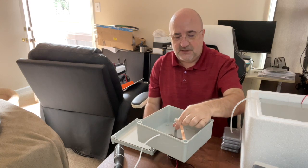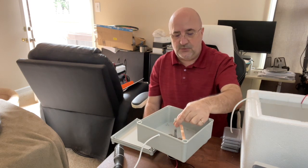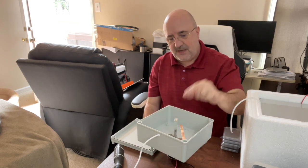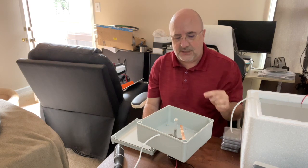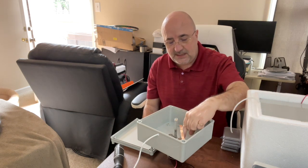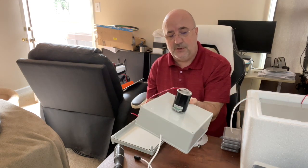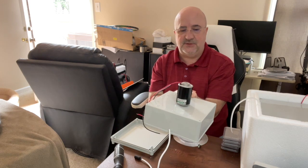This is my shaft: a 10 millimeter OD, 8 millimeter ID polycarbonate tube with an M6 threaded insert that I threaded in. Unfortunately, threading them in, they don't go in straight. Sometimes you get it right, but two out of three times it goes in crooked or the tube splits. That's mounted through the shaft with a pin — the motor shaft with a pin — using an M3 screw.